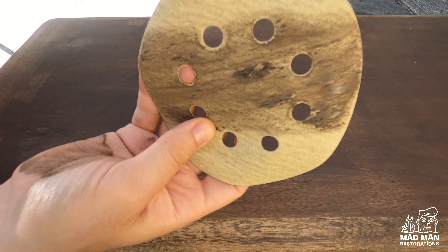Here is a side-by-side comparison. The right side was wet sanded and hand rubbed, and the left side was not. Not only is the right side smoother, it also reflects the light differently — it does not reflect as much, giving it a more satin look than gloss. Now here it is all finished. At this angle you can see the sheen and it looks amazing — just like it did from the factory.